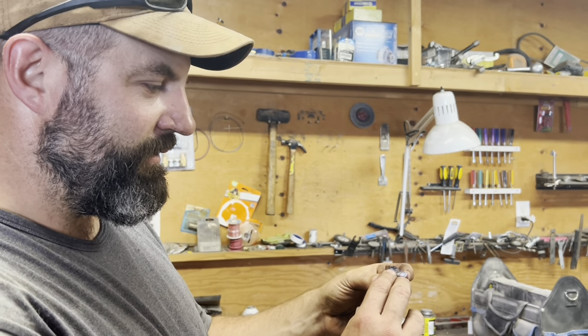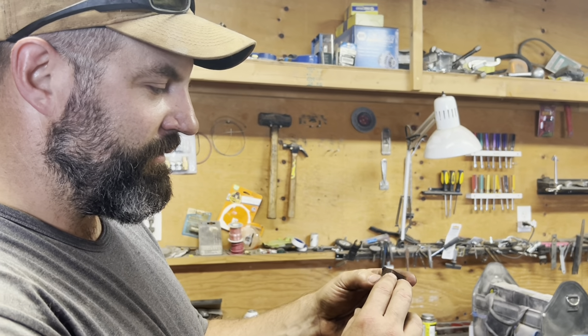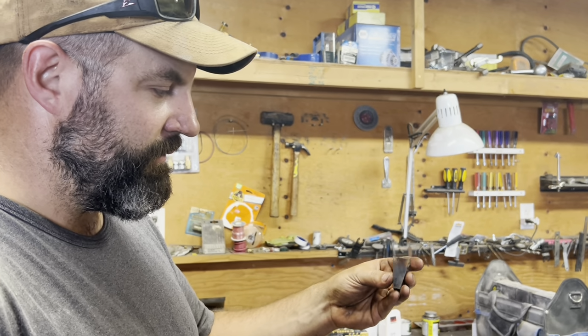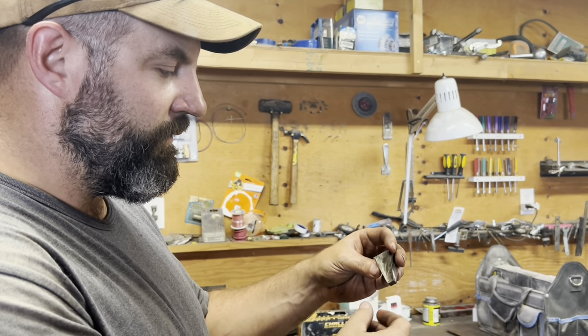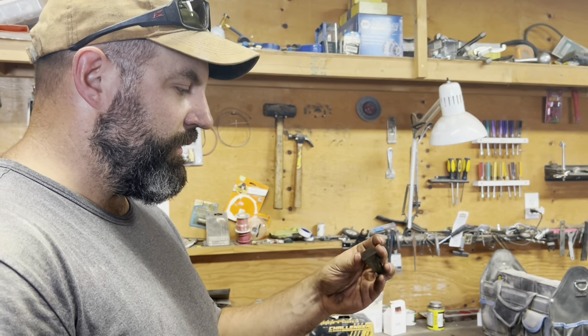So I'm going to chamfer this top edge, probably about 1/8 of an inch, just to soften it up a little bit. And I guess these edges as well, just to ease them over a little bit. Polish it all up and weld it on.